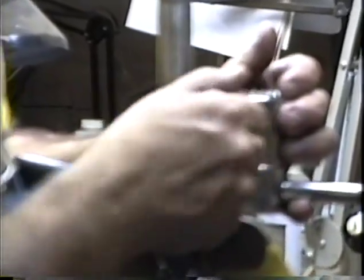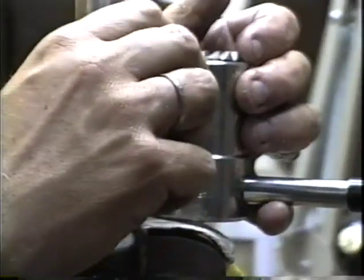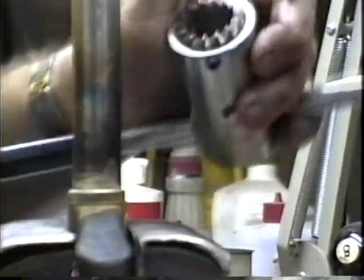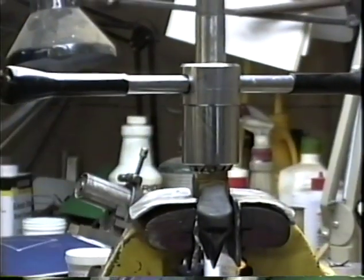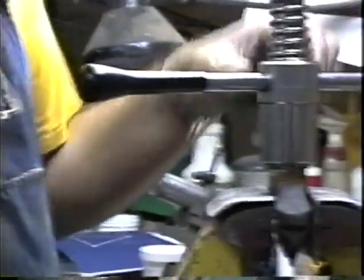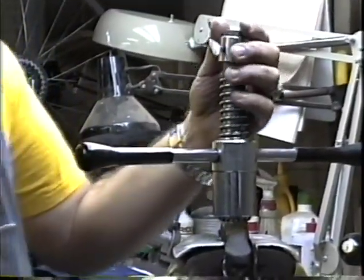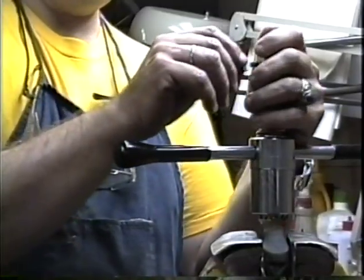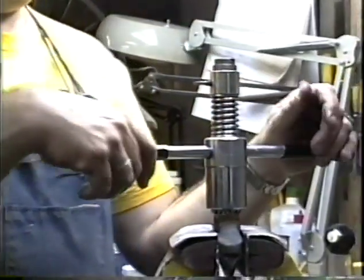And we'll take a little Allen wrench and snug it. Just notice how I'm snugging it with my fingers. Don't torque that, because you could risk cracking your cutter. We'll slide this over gently, don't drop it. This is the spring that comes with the tool. This is the top half of a dummy headset, and I'll explain the dummy headset later. Push down and set it.